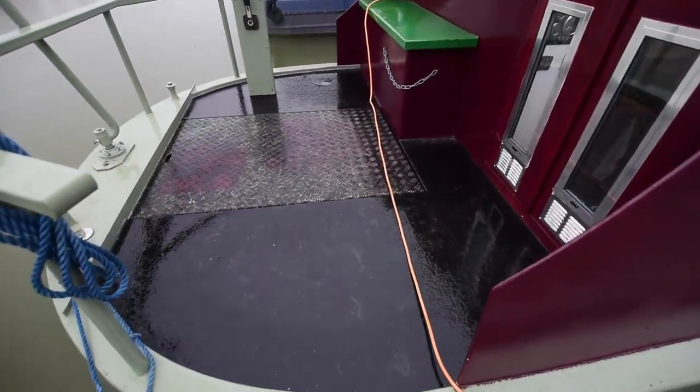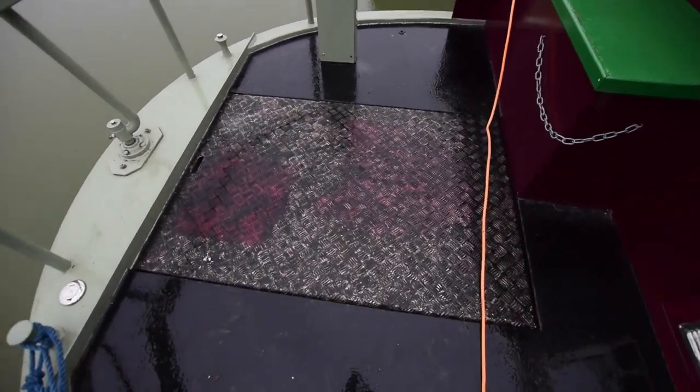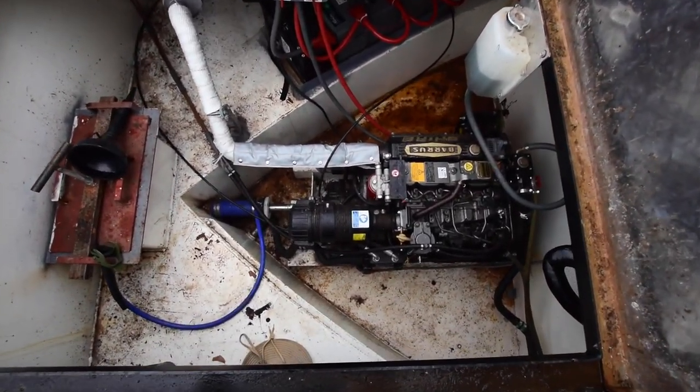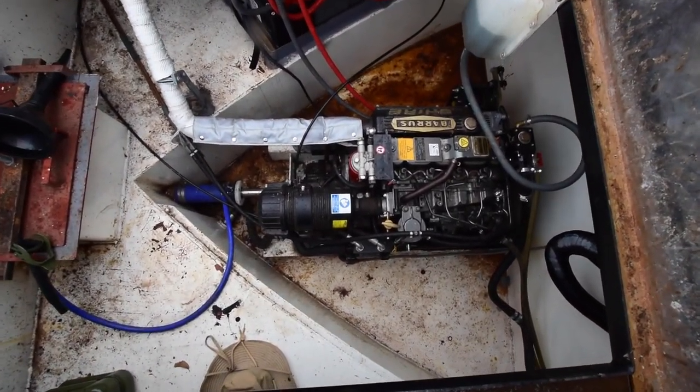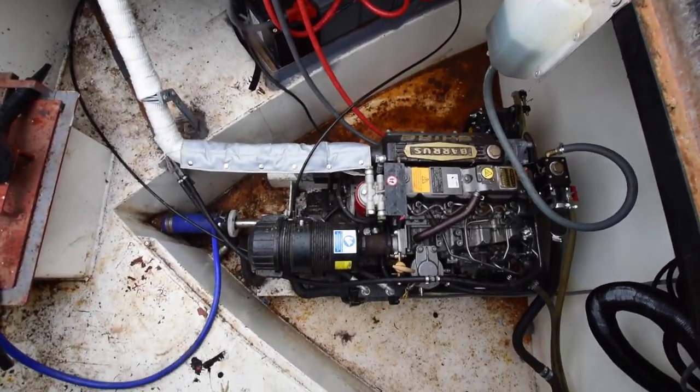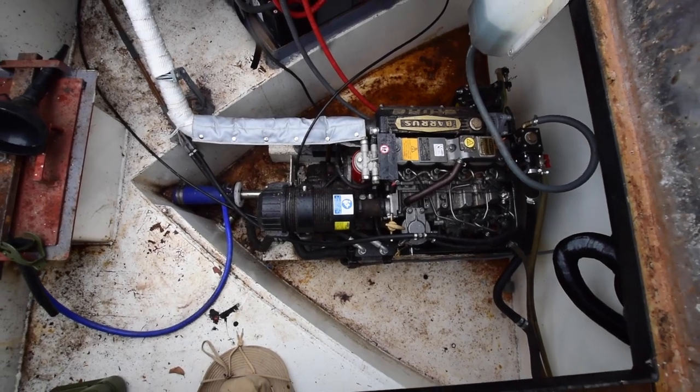At 10 feet wide these boats are great — they're easier to handle than the 13-feet-wide boats. The engine's under here, I'll just show you that quickly. Batteries at the top of the screen now — there are four domestics, 110 amp hours each, one starter, and there's a bow thruster battery on board. The bow thrusters are Vetus 95 KGF.